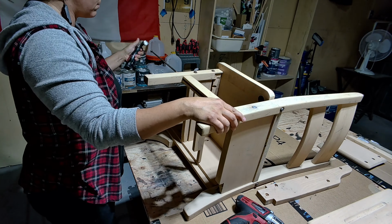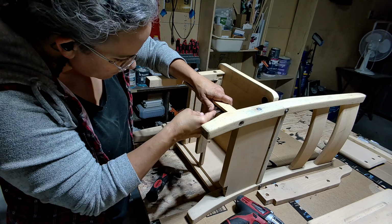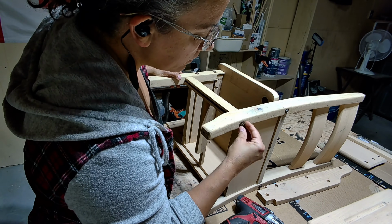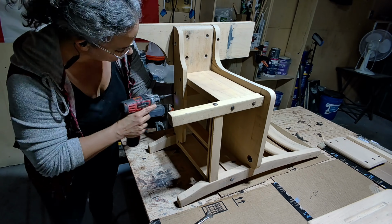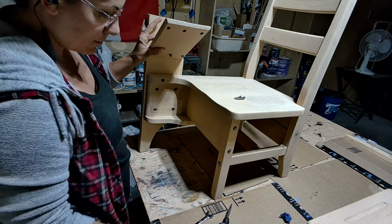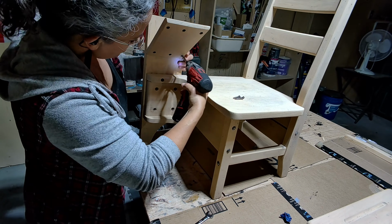Since this piece is going to be used for children, I made sure to add several layers of top coats. So that way it really stood the test of time and stood up to the abuse that children often put pieces of furniture through. I used a non-yellowing top coat so that way it would not amber over time and change the color of the tan wash.